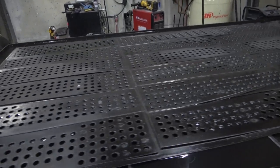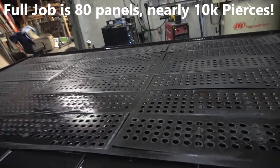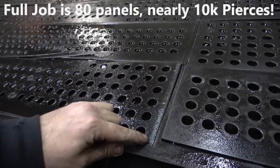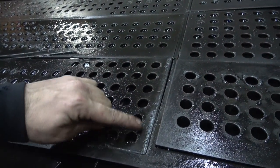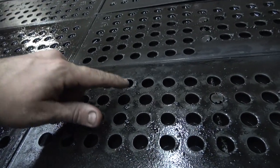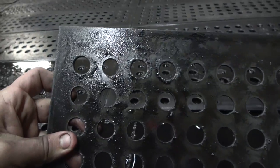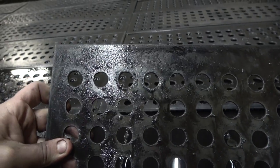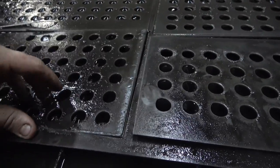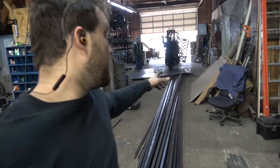We've got this whole sheet — there are 18 panels in this sheet. We used up the dead space at the end of the rocket stove so basically no waste. The consumables burned out right as they were cutting down here, then jumped over and did four holes before I heard the problem and stopped the machine. Changed the tip, came back, re-cut them. After a little wire brushing they'll be fine. This edge actually gets buried in the final design so it doesn't even matter.